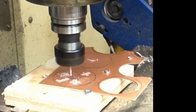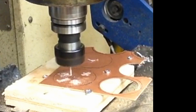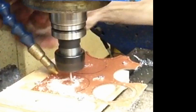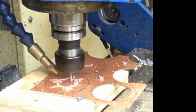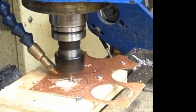You're never going to see it and it's going to do exactly what it's supposed to do, so I don't optimize tool paths. This could be built several different ways — the only reason I'm doing it with the CNC mill is because I can. This could just as easily be an etched circuit board; there are lots of tutorials on etching. The only thing that's precision about this at all is the placement of the six ball bearings, because you want them to be consistent so you've got the same contact across all three contact points with the brass bars. We're just letting it run here — I cut the centers out once we got the circuit board top levels cut, heights are not exact.